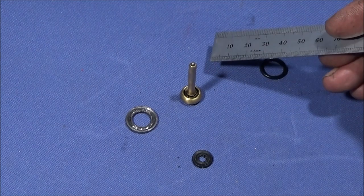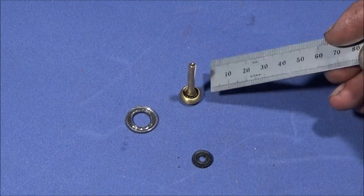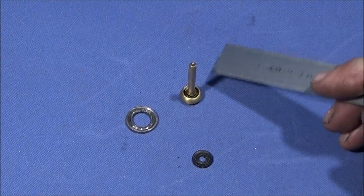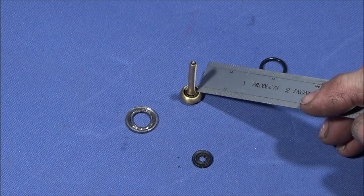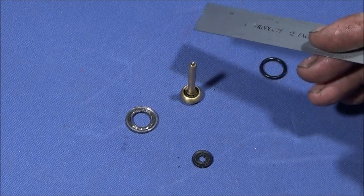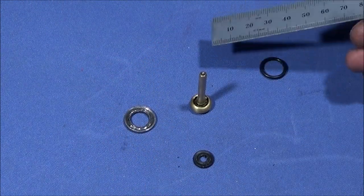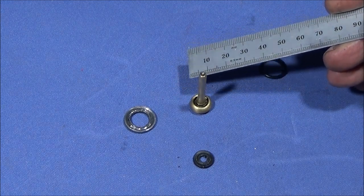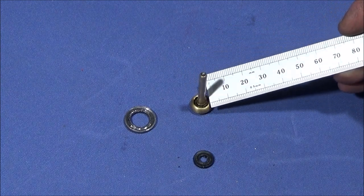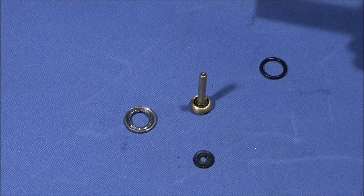I had a few attempts to get it right. At first I used a rubber seal in here but under pressure that would work loose and come out, so in the end I made up a PTFE seal to go in there just below the face, pushed that one in on a nice tight fit, and it's drilled to go down over this shaft. Then I got the housing for this pin assembly, put the housing in the chuck of the lathe, and held this one tightly against the end so that the PTFE seal was lapped in — and when I did that and put it all back together again it worked perfectly.